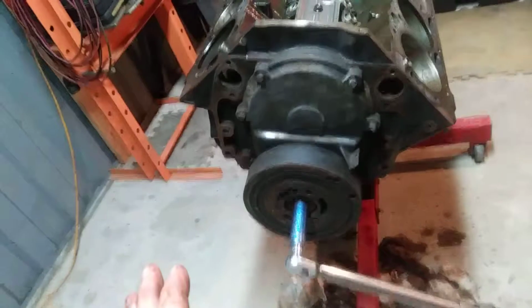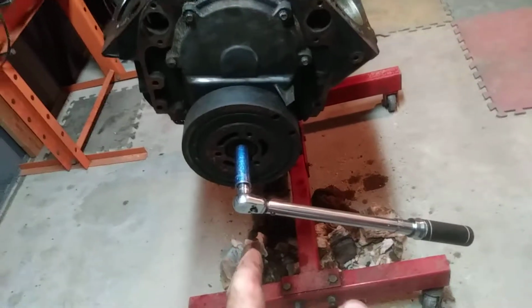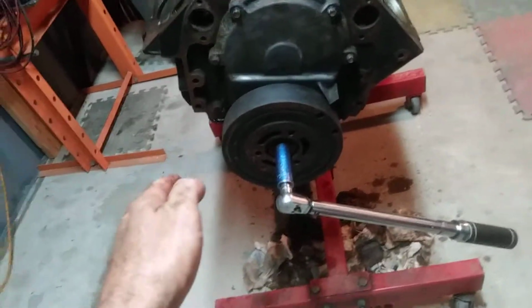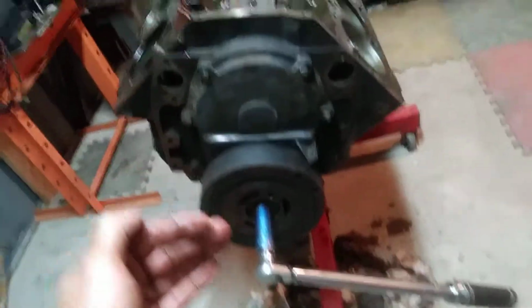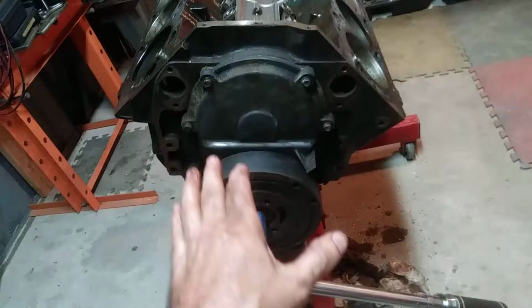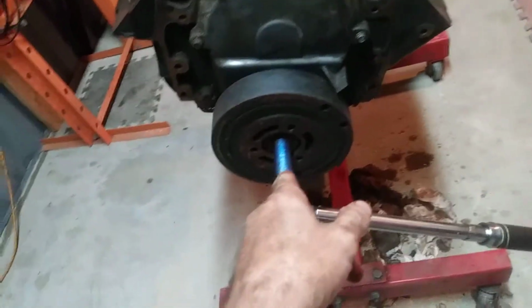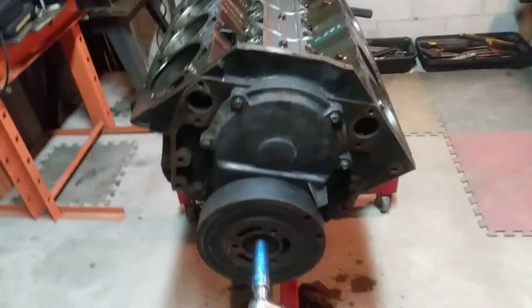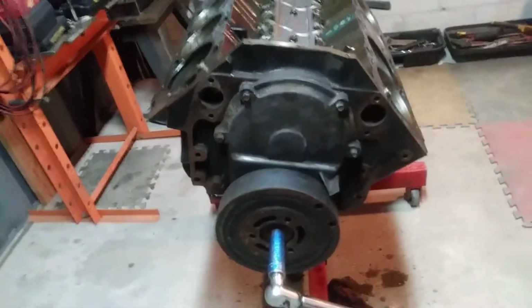In other words, if you're in your boat and you pull the spark plugs out on an engine that has been running, you should be able to put the torque wrench on it. Keep in mind your raw water pump has a lot of grip, and if you've got a bad water pump that might be tight, that'll give you a false reading. But if you're able to loosen up all the belts, loosen the alternator, which loosens the belt on the water pump, and even loosen up the raw water pump itself, which has the impeller in it, then take a reading of the rotation of your engine, which I call a rotational mass test, you will feel everything. Nothing can hide from that, especially when the spark plugs are out.